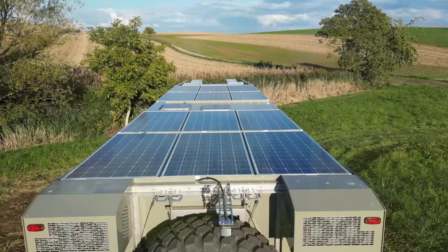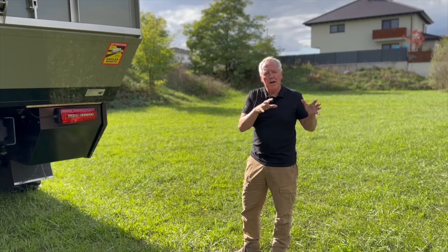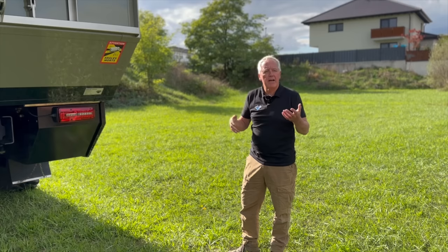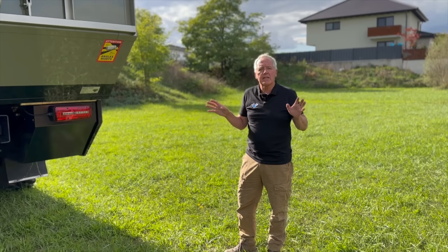And there is another technical detail on these air conditioners. They work directly on 24 volt. So we take the power from the battery and run the compressor and the fans and everything directly. So the consumption is lower and we don't need huge inverters to make AC from DC to run an air conditioner. So it's very direct, it's straightforward and a nice, very nice system.